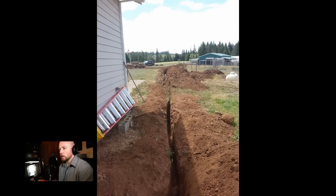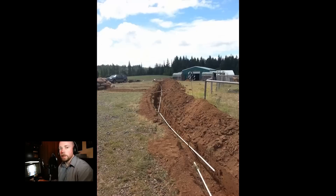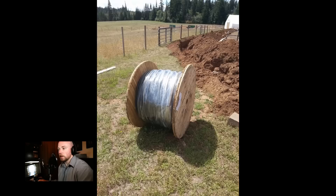You've got to get down about three feet, which is what's required. This picture I'm showing because not only did I sink wire in the ground, but I also put a pipe in for methane to our propane tank — which eventually we want to get rid of — and be able to actually plumb biomethane directly into our hot water heater and cooktop in the house. We think we should have enough methane to do that job. The piping is in and everything is just sitting there with caps on the end, but it's ready to go. There's the big spool of wire — again, 750 feet.